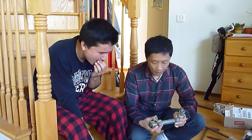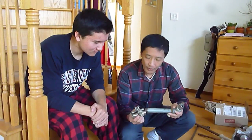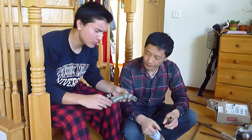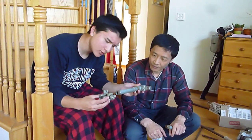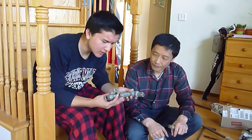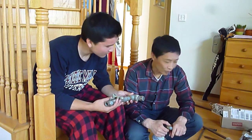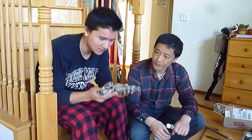We had a house we bought, and when I went to the crawl space I saw this pipe with this pipe. So Dr. Zhang, are you saying that people who have galvanized pipes try to fix the problem by putting on this clamp? But what you're saying is, even if they put on this clamp, it's going to leak eventually, right? Yes, sooner or later. So sooner or later it's going to leak anyway — this is one of the prime reasons we should replace these galvanized pipes.